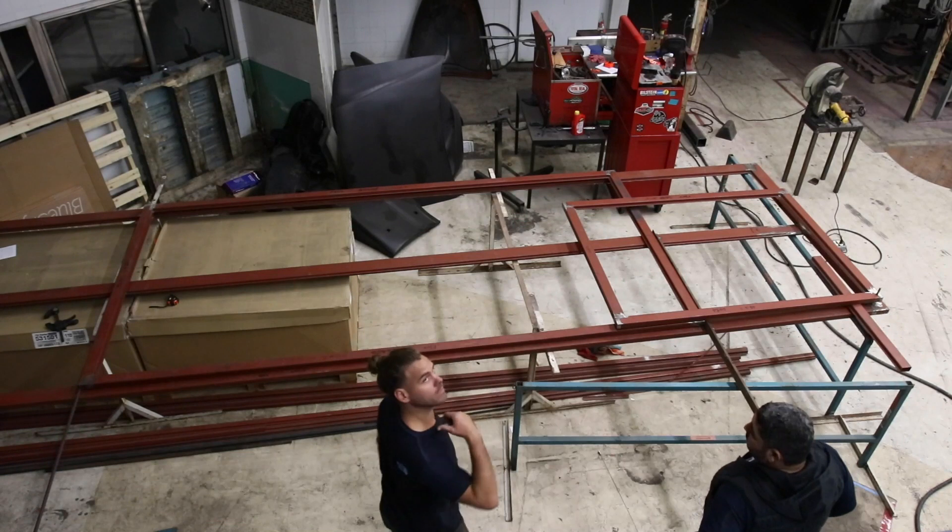Unfortunately, this is as far as we got with the solar array for this week, so you'll have to like and subscribe to see it all really come together. But you get the basic idea of how it's all coming together. We just had a successful test run. A lot of hours of SOLIDWORKS — figuring out the geometry, the pivoting points, and how to connect and interact with all the panels — and literally in one afternoon we didn't have to investigate anything. We didn't have to go trial and error. We just measured it. Every pivot point, every pivot point just works. It's really cool to just go from computer to metal and make everything snap. We think we're two to three days away from making everything smooth and on the van. We'll test every single mechanism on the ground first — on the shop floor — check control, check all the motion, and then hop it up, get it on there, and start testing the tracking.